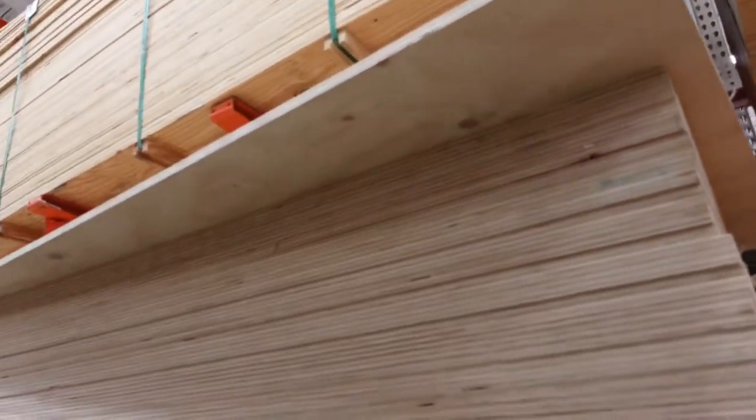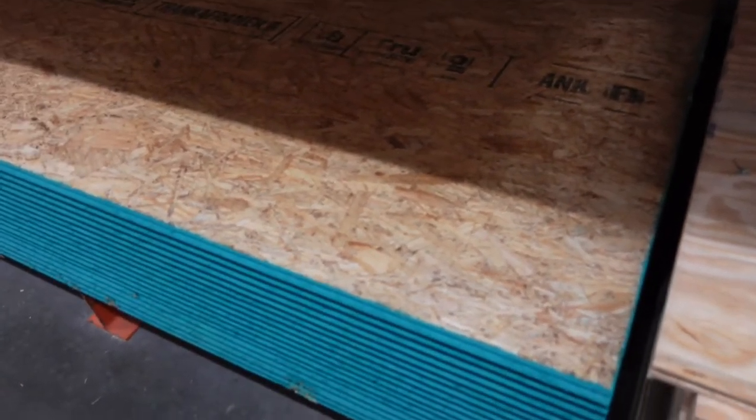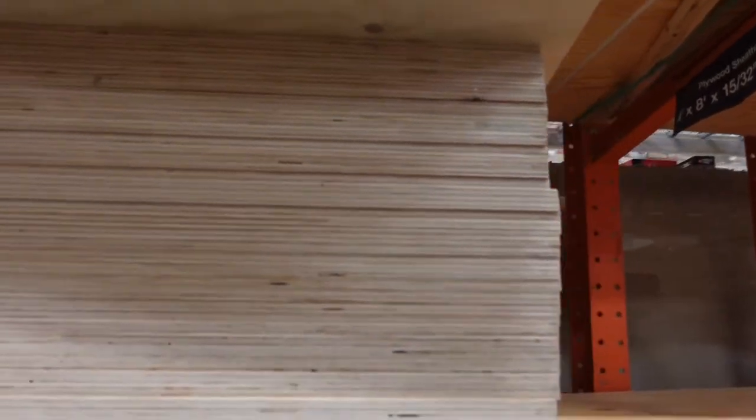This one right here I'm not too familiar with, but I happened to glance at it and touch it and it's really thick. I feel if you were to use this one to build a box, you would have to use a good liquid nail, screws in it, and actually pre-drill and screw it together, because I feel like the staples would blast through it. But it could probably be good — we're going to have to build a little box one day and see. Like, this type of plywood is no good for boxes, but if you're doing long panels on a boat or something, I would imagine it'd be good because it's long and thick. I think upholstery staples would hold on to it pretty well. I would just highly suggest doing screws on it instead of staples.